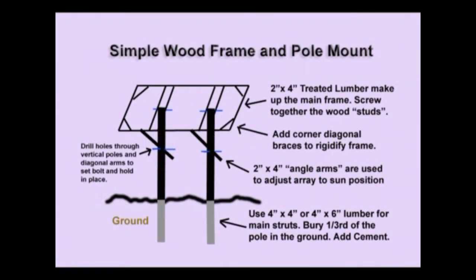Here's a classic wood mounting frame for two, four, or six panels on a mount that's near the ground but lifted up between four and twelve feet, using all-wood construction. You construct your frame on the ground — the two-by-fours in the center of the frame are spaced out so that they can fit on the top of the poles with a half-inch axle or nut and bolt through it. I'm using four-by-four main poles for two panels or four-by-six for four panels, and you go up one more size for six panels.